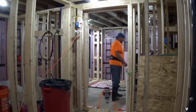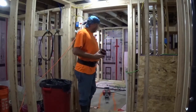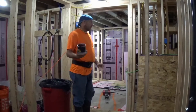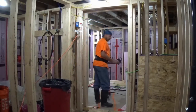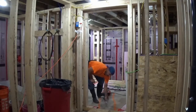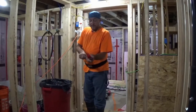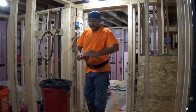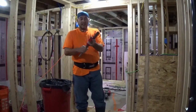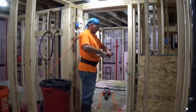On the jackhammer itself, you're going to have tool inserts. You want to make sure you grease your insert — your tool bit. This is just bearing grease, for use in farming, trucking, and construction. I actually talked to one plumber who said he doesn't grease his jackhammer. Well, then you better not hire that guy, because if he doesn't care about his own tools, he doesn't care about your project either. I always grease my tools — they recommend it. If you rent one, they're probably going to tell you the same thing.